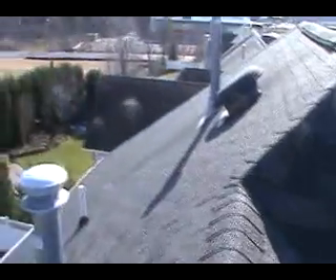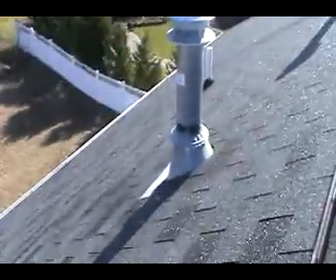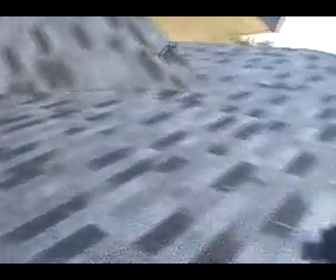In summation, go to each one of the vent stacks, flue stacks, caulk those — black caulking. Go along the front of the roof here, replace those shingles that are broken or missing. There's one broken there. And then go along any of the roof that's exposed to the wind on this front side, check the front of the shingles. If it needs glue, glue it down, push it down, press it in.